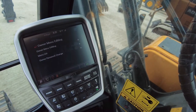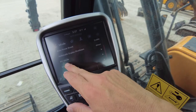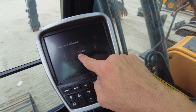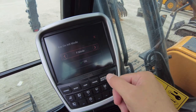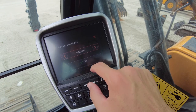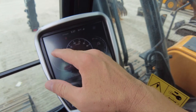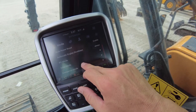Currently I have this disabled, but we can enable that. The other important thing is to change the initial mode. From the factory the initial mode will come in at E, which is the economy mode. You want that set to P so that when you key off and key back on, the machine will be working in its maximum performance engine power mode. Now when we key off and key back on, it will default back to P. Very easy to change through the main menu — the mode menu — come down to initial mode and change that.